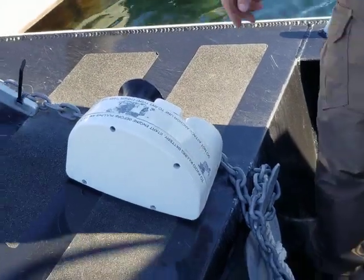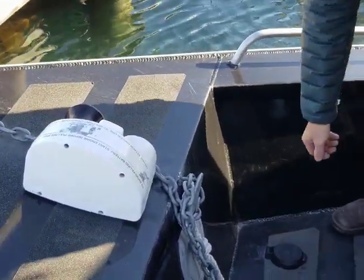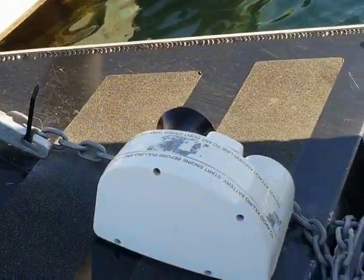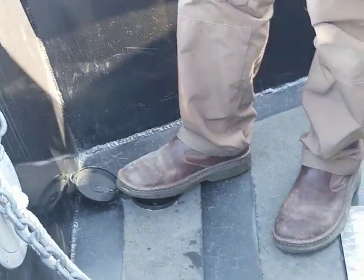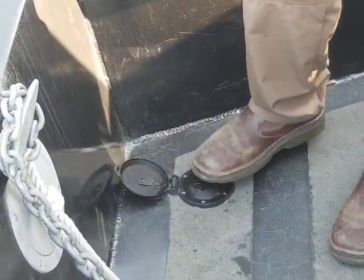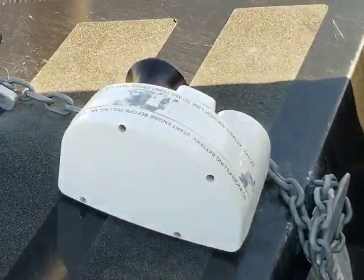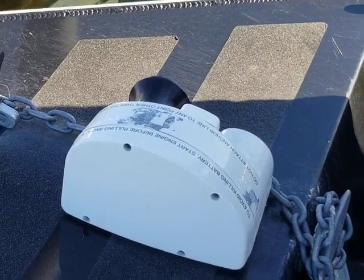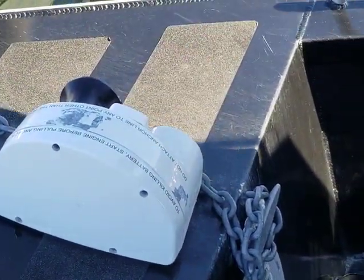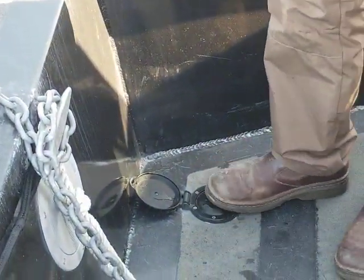To use this winch, you bring the line across the top first. I usually wrap it twice. And then when you step on this foot switch and pull, it'll engage the line and lift. That'll only pull the rope portion. When you get to the chain, you have to pull that by hand. We had a couple of people that forgot to flip the lid up and they said the winch didn't work, but it'll go. And this thing sounds horrible, it's mounted on this big aluminum drum, essentially. But that's how they sound new, and I don't know what to tell you on that.